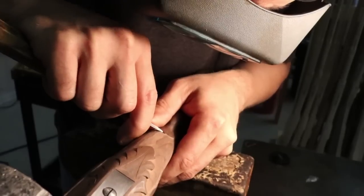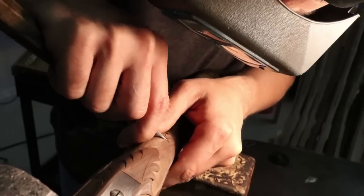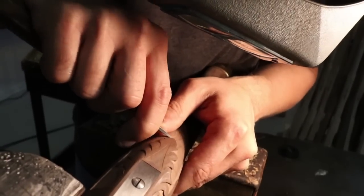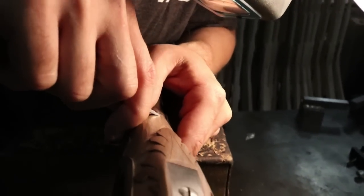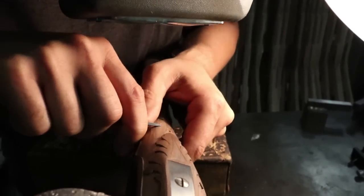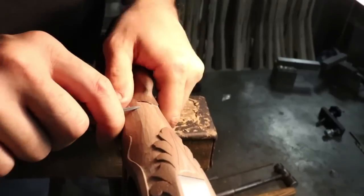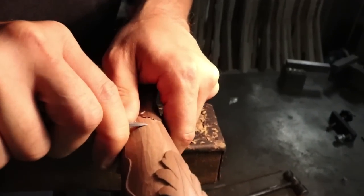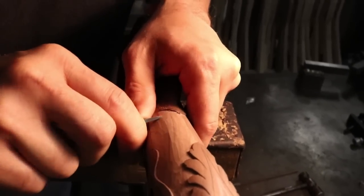We're getting around that little dot and defining the comb. You can also use the skew chisel on the bigger areas too, which works pretty well. What I'm really trying to do is read the surface and read it for shape and high spots, all while trying to maintain a smooth cut surface. Now, I'm going to go ahead and use the skew chisel down through here. When I'm working up against a feature, ideally you don't want the tip of the tool to cut into the feature — that'll just damage your edge.